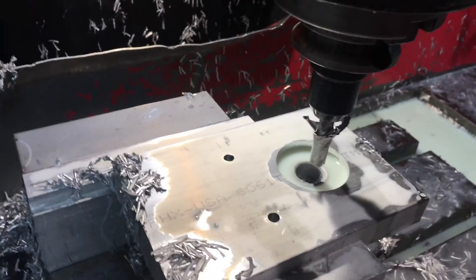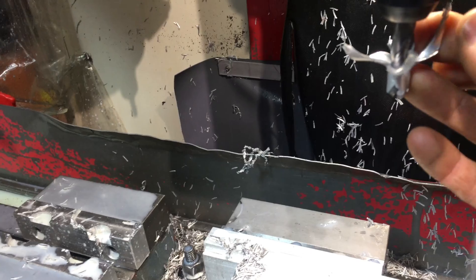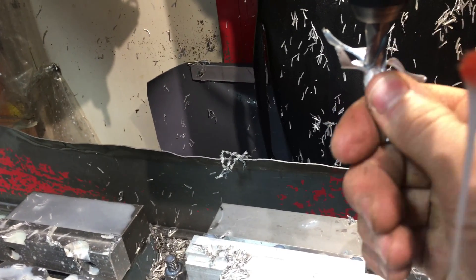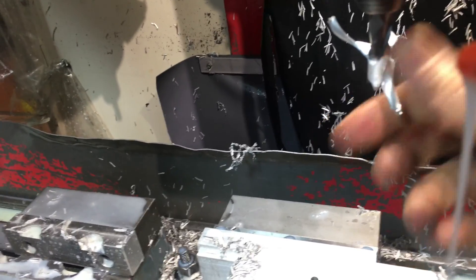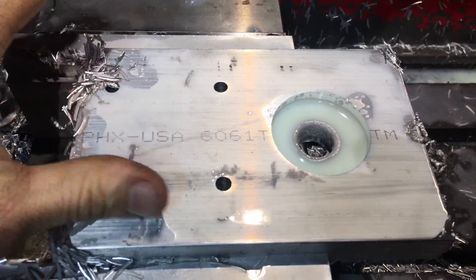Went a little too deep on that one — that's what happens when you get greedy. The aluminum just melts around the carbide and sticks to it. It doesn't completely trash the bit unless it breaks off some carbide. If you get the aluminum off, you can still use the bit for roughing, but I've never had really good surface finishes after something like that. As the aluminum welds to the carbide and then breaks away, it dulls the edge pretty significantly. I can still rough with it, and for this tool holder I'm making, it won't really be a big issue because this is just a shop tool.